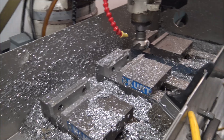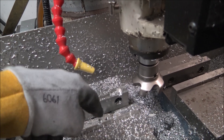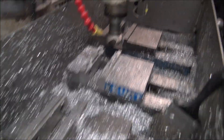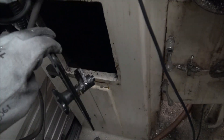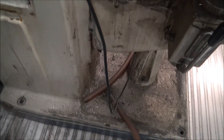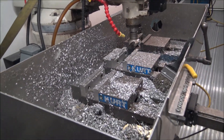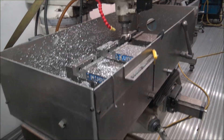When you're cutting parts in aluminum, you want to keep coolant on it, flooding it, so it cuts clean and the part and the cutter stay cool. The coolant comes out of the head, drops down these pathways and hoses, then recirculates back up. When you buy one of these, they don't come with a big tray around it to catch it all so you can recirculate it, so it gets really messy if you don't have one of these.